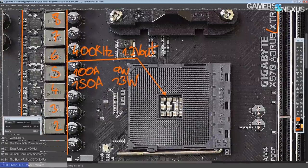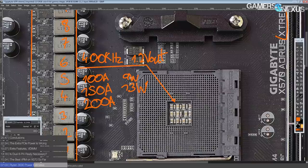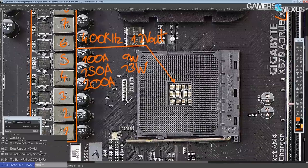It's extreme. It's very extreme. Going up to 200 amps output — which is probably where even the 16 core maxes out for Ryzen 3rd gen — that sounds to be the upper limit of what any Ryzen 3000 series CPU will ever pull. And at that point on ambient cooling, this motherboard should be producing about 16 watts of heat. The motherboard still wouldn't care.